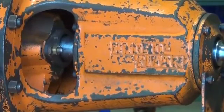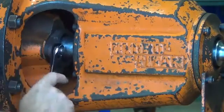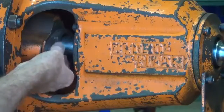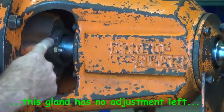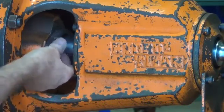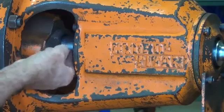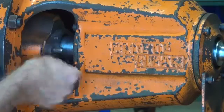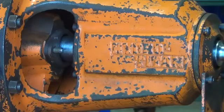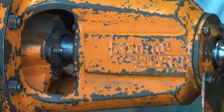Let's get started and just pull the gland out of this pump by undoing the adjusting nuts on the gland. What you can see about this gland is that it is hard up against the stuffing box, which means the packing has used up all its compressibility and flexibility. There is no more adjustment in it, which means that pump would probably leak or start to leak. It also means that the packing could be hard — it's lost all its lubrication, so the shaft turning could get very hot and the friction can burn grooves into the shaft.